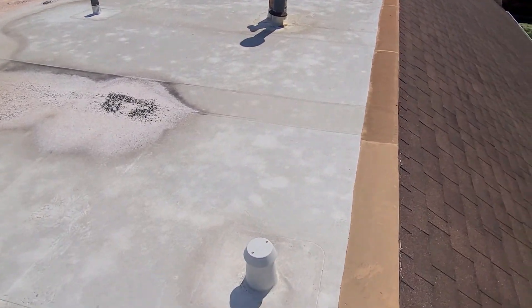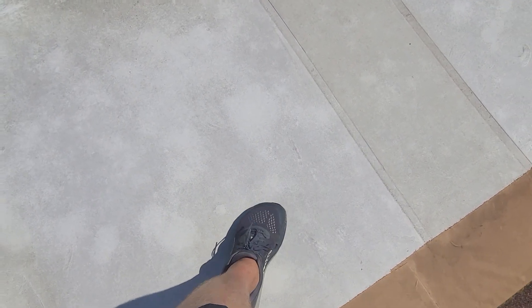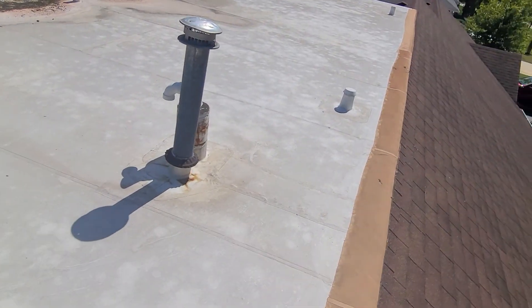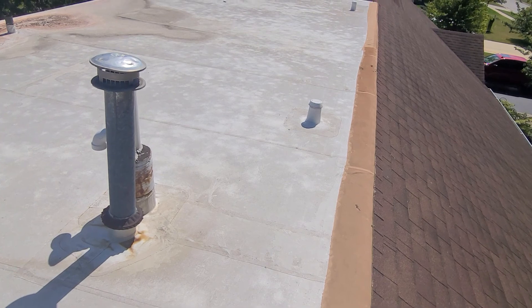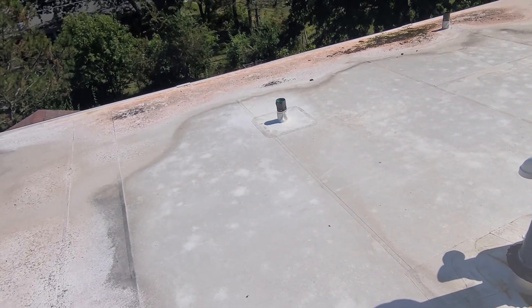This flat roof's in pretty bad shape. The material itself — there are many indicators on it, just from being a professional roofer, that it is getting old. But then I have some major structural concerns as well, and maybe not so much structural as just the decking underneath there. I can really feel it's giving away underneath me. I can feel some cracking. So when we're talking about replacing this roof up here, which I am going to fully recommend, we're not only getting to the roofing part of it, we're getting into decking as well.